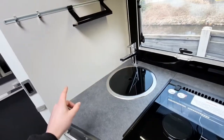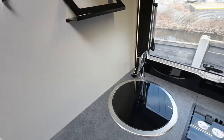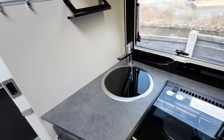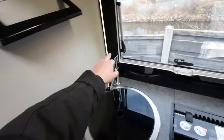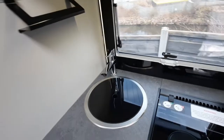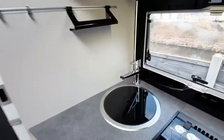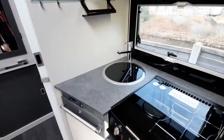Once you've done that, you can leave your pump on at the control panel, as all your taps have a micro switch — they'll only activate the pump when you need it. So you're never going to burn it out. The only time you will burn it out is if you've no water in the system, so do bear that in mind.